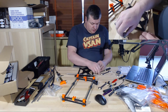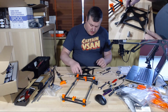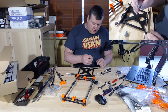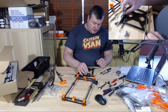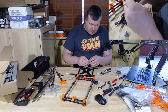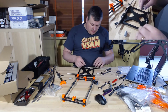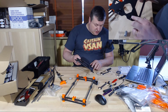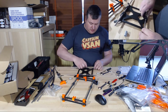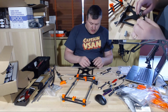I just tested out to fit the plastic bearings in here and here, and with the U-shape fasteners I barely could tighten the nuts before I felt the bearing was collapsing, and when I put them both, so the nuts were just about touching, it was very stiff. Same here, if I put the screws just hand tight, those bearings started to bind up, and they're just collapsing under the pressure.